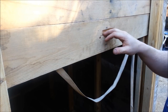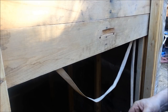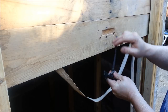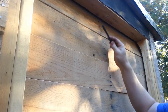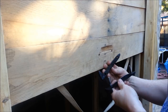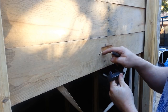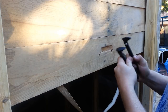For the bottom slot, I took my skill saw and dadoed out a hand groove. I took a railroad spike and welded a piece of sheet metal to the top, bowing it out to give more of a handhold. I don't have much clearance at the top so it has to slide through — I couldn't use a full railroad spike — but I also wanted a handle on the inside and outside. After it was bowed out, I welded a little piece of sheet metal so it fits on the edge, then drilled holes all the way through both pieces and cut the heads off bolts and welded them in.